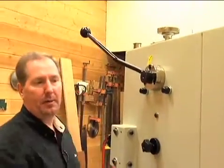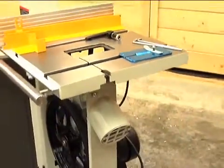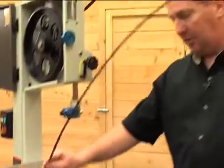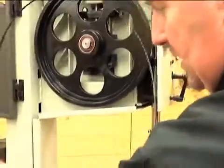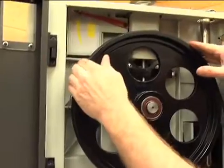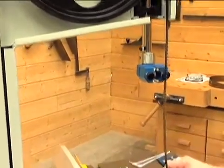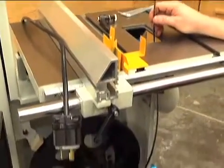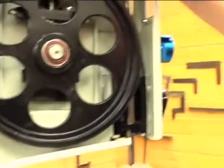Next, release the tension by putting the lever all the way up and remove the lock handle — this basically locks the two halves of the table together when the saw is in use. Now we're ready to install the blade on the saw. Simply take the blade, come through the slot on the side, turn the corner, and on the frame side of the saw simply insert it through the slot, hang it over the top wheel — making sure it's roughly centered on the tire. Put it through the frame of the saw all the way down, loop it over the bottom wheel, and again try to keep everything fairly centered.